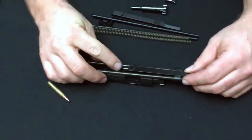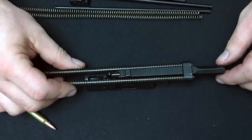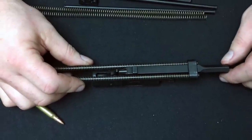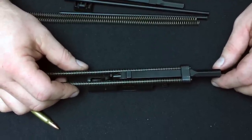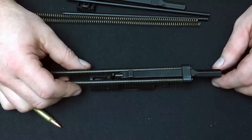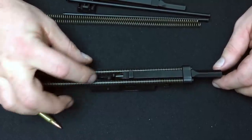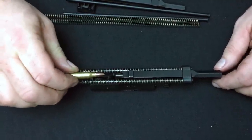What you're going to see here is actually a firing pin safety, similar to what HK had to do on their 416. Now these were done for two totally different reasons. The reason the HK one was done is because your rate of fire was so high, you were having slam fires. The gun was being overgassed, and it was causing it. This one, again, was all done because of one specific cartridge that the factory tested.